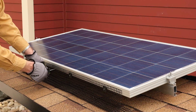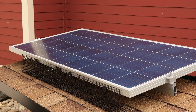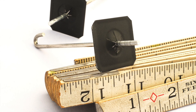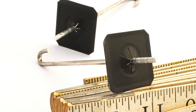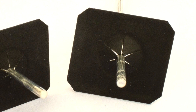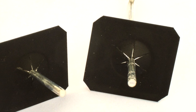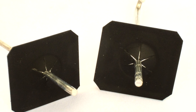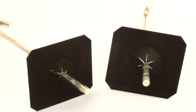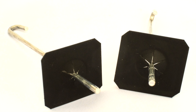It installs from the outside, eliminating the need to reach awkwardly behind the screen. Unlike similar products, Spiffy Clips are manufactured from two different aluminum alloys — one hard and one soft. This ensures that the prongs on the one-directional washer bite into the hook wire and stay in place. This composition also means that the hardware expands and contracts at the same rate as the panel where it is attached, and won't work loose over time due to the extreme temperature changes found on a roof.